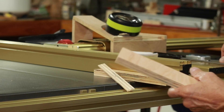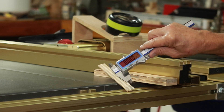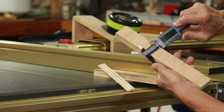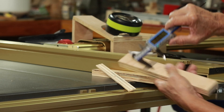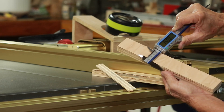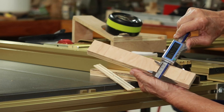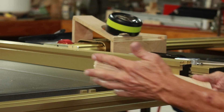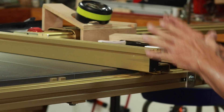These are set and these cuts are an inch and a half — okay I'm at zero. So this was my last cut: one point five zero one — one thousandth of an inch off. I can deal with that. One point five, one point five zero one, one point five zero zero, one point five zero zero, one point five zero one — actually one point five zero zero zero. Perfect. So within one thousandth of an inch now, all of them — that is perfect. So once again, finally, after three attempts, this is dialed and set in again.